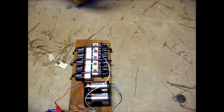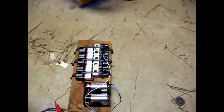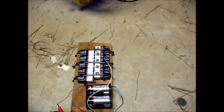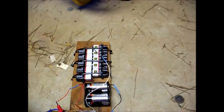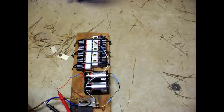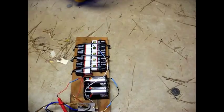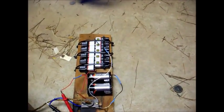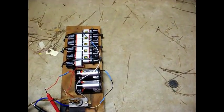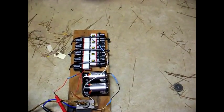For the B batteries, I have 10 nine-volt transistor batteries daisy-chained in series. I used the cheapest batteries available at the dollar store — a dollar a battery. The current draw on the B-plus battery is very minimal, so those batteries should last a long time compared to the two D-cells for the filament voltage, which will have to be replaced much sooner.